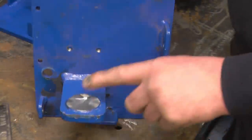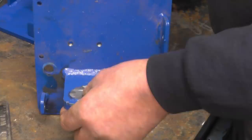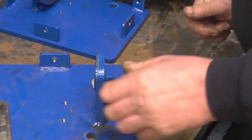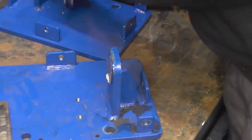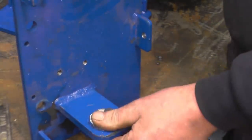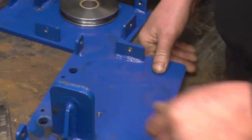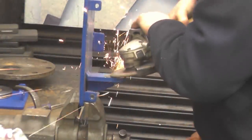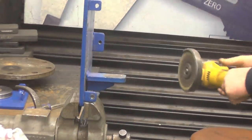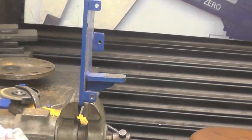I've cut that off and I'm going to mill that off there. I'll take that support bracket off, make a new bush and weld it in — or at least make a new pin and weld it in. I will modify it so it's got a grease nipple in, so it's got half a chance of lasting a little bit longer. We'll get this in the milling machine and mill that off. You could use a grinder, but I don't want to put grinding dust into any workshop.